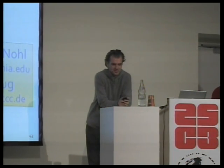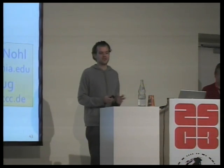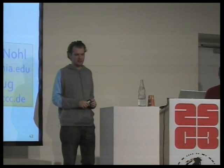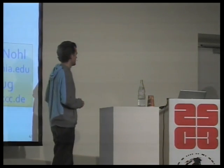Doesn't the cost go up as well? Does the cost of reverse engineering go up? I mean, doesn't the cost go up as the chips get smaller? Doesn't it cost you more to reverse engineer? Oh yes, yeah. So a focused ion beam you won't get below $300,000, whereas the microscope we're using now is about $1,000. So it will definitely cost more to reverse engineer. But if you find a bug in a Pentium 4, I'm not sure how much that is worth anyway. Yeah. So it might be worth the 300,000 investment in the FIB right there.